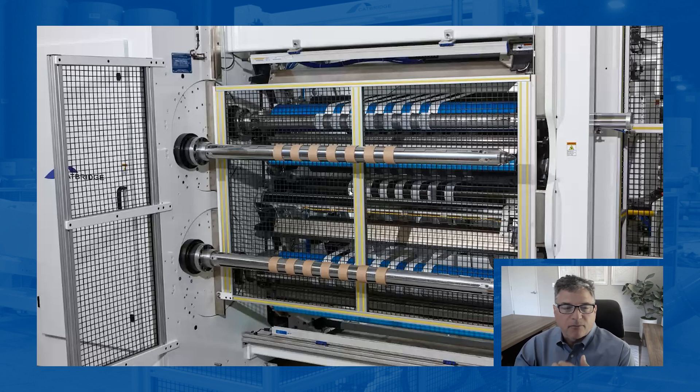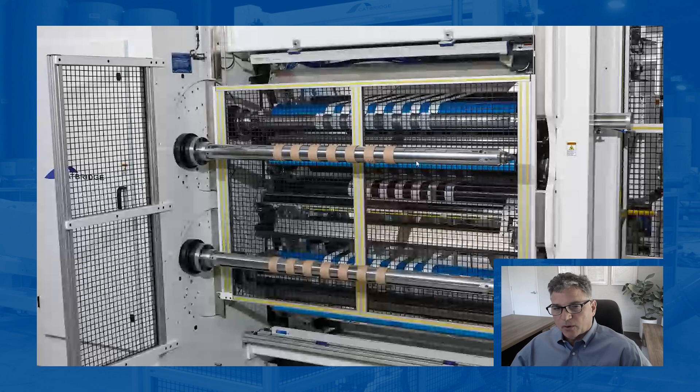People typically have a pin rack with all their common jobs — one-inch, two-inch, three-inch in this customer's case. It allows you to put it in there and get your cores accurately set up across the shaft without spacers, without accumulated tolerances, and done nicely. The direct friction means that the spinning is actually occurring on the body, and we're using a segment where we vary the air pressure to control the torque. We also use other modes regularly, including a specialized mixed mode style tension control method, which we find we use most often with this particular shaft and it gives great results.